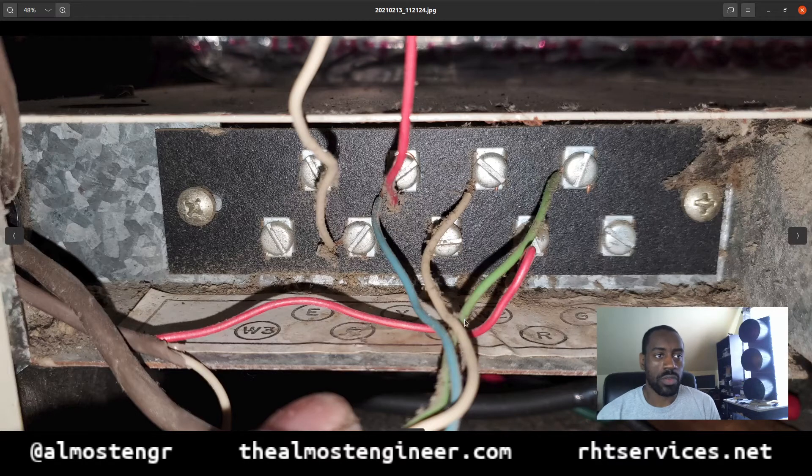The blue wire goes through Y. This white wire actually said W2. I looked and I didn't see a W1, but I may have overlooked it — I do see that there's a W3. As I mentioned, this particular unit had electric heat. If you can see down here at the bottom, this is the 240 voltage that goes to the resistant heat. Basically the resistant heat — if you're not familiar with it — is where you have those metal coils that heat up when you run electricity to them, similar to an electric stove or electric oven, but in an HVAC unit.